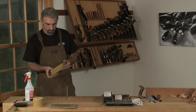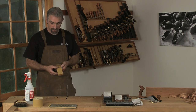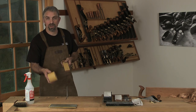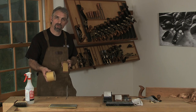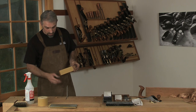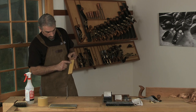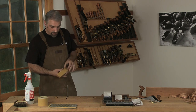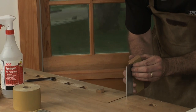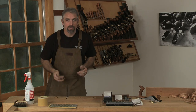You can also use a block of wood — a flat block with sandpaper. We have adhesive-back paper in grits ranging from 80 to 400: 80, 180, 220, and 400 grit. It's nice because it just sticks right down. Another trick is to take the plane blade in the tool and run a trough in the block you're going to work, so you're matching the radius exactly. If you have a flat block, just follow the angle and dress it down to where you need it.